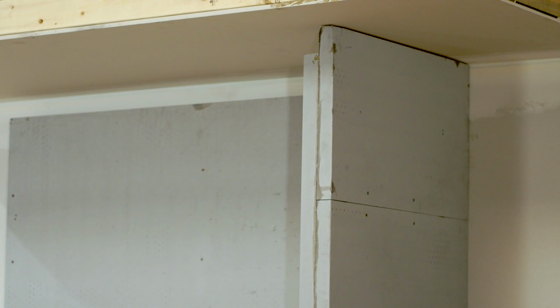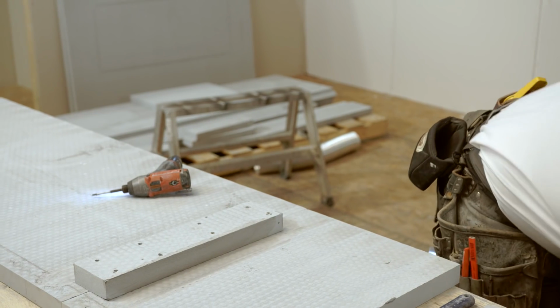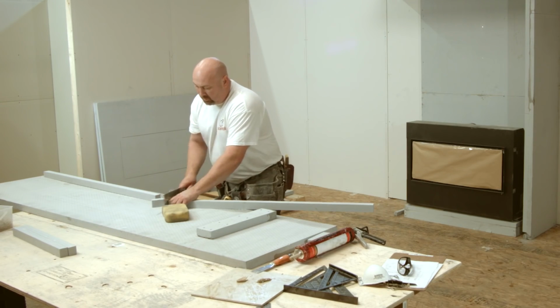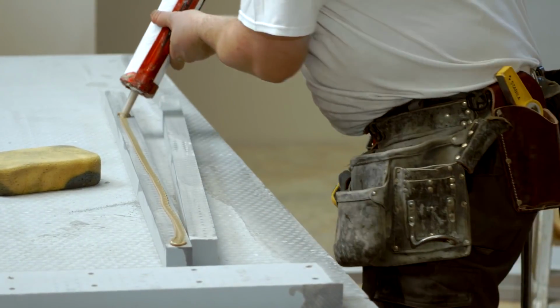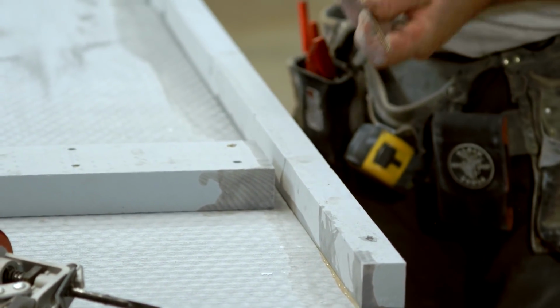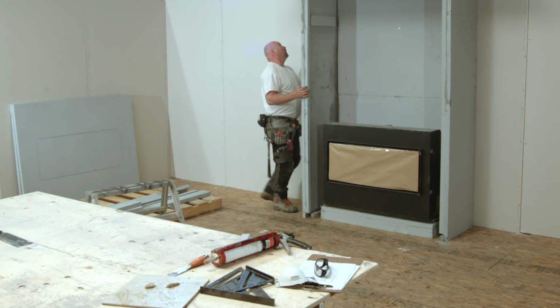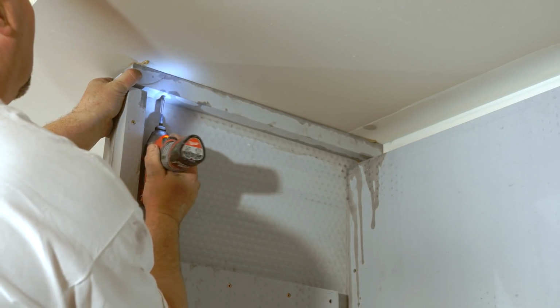Depending on the height of the surrounding enclosure, it may be necessary to pre-assemble your panels using 2 boards. These boards must be supported using a minimum 4-inch wide joint plate. Next, add your support blocking to the front edges of your pre-assembled sidewalls. Now that your sidewalls are installed, add 1.5 inch support blocking to the ceiling.